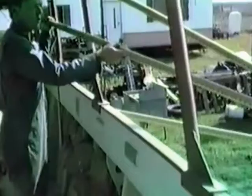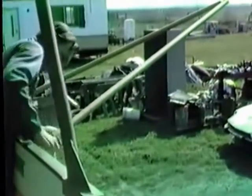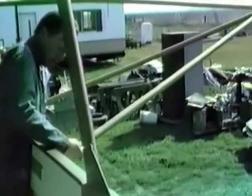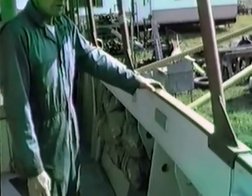These are paravanes that will be suspended from the tips of these tripods, tripod masts on either side. And the scientific name is an anti-roll stabilizer that most of the fishing boats on the West Coast use. So when you deploy those in the water, there's a pin outside with latched, and the paravane then is suspended by a cable from the tip and rides maybe 6 to 8 feet underwater and will then stabilize the boat as she's moving forward.